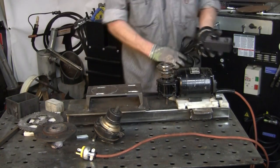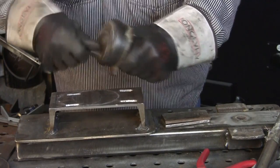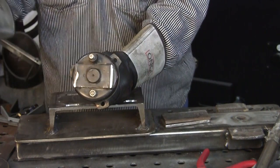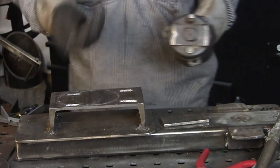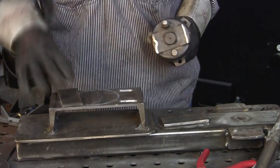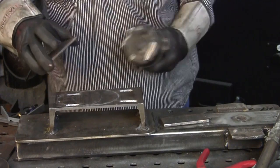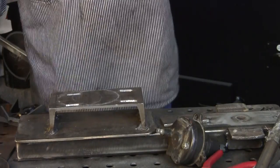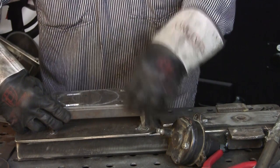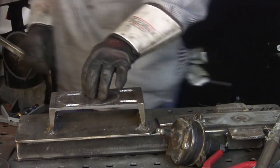Here's the plan: we've got our bearing and our little hub here. Underneath it there was a bracket that came off — I had to cut it off because that's how I was able to get it; it was in a wreck. So I'm going to take some flat stock, weld it on like this — I've already got the existing slots, so this will go in here, weld on, and be able to slide. I'll cut the hole for the bottom of this to drop through. Since I'm cutting that hole, I need to strengthen up the channel, so I've got some bar to put underneath and run a bead — kind of like a gusset so it doesn't bow.